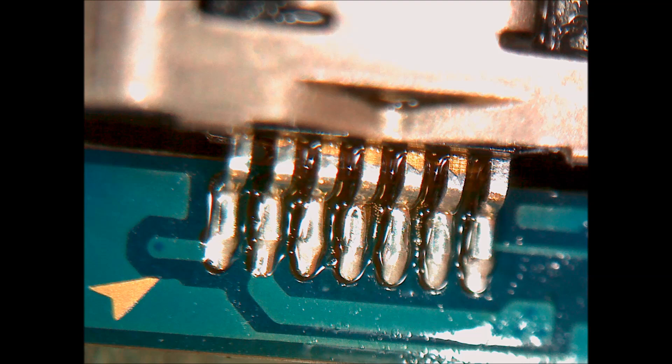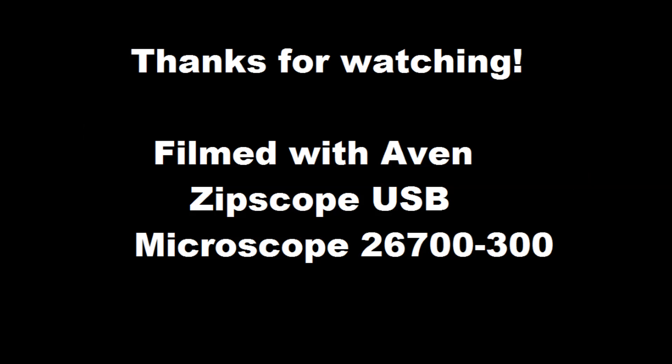The solder is not just on the bottom of those pins — it actually encompasses the whole pin and goes all the way up to the top on most of them, giving a much nicer, more secure connection that will withstand a little bit of movement from the charger. It should be charging just fine after this. That's all for this video — I hope this helps and good luck.